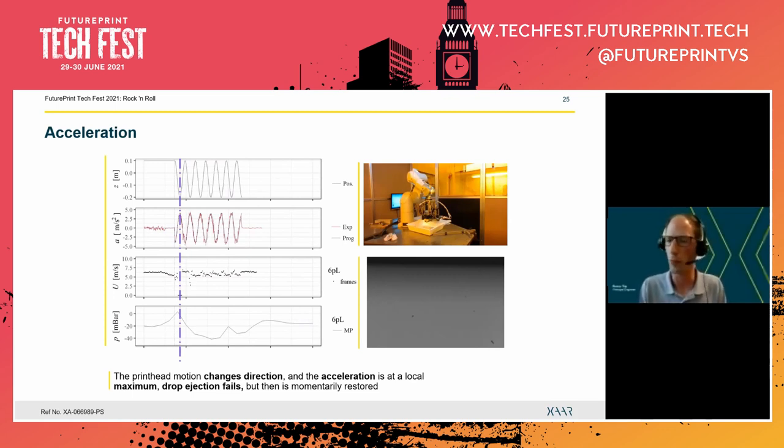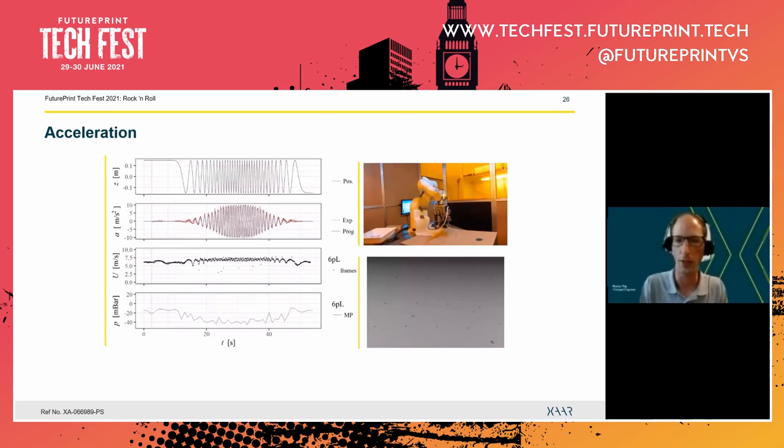So when we saw this, we thought, maybe we can actually do a smart trick. What if we don't start with the maximum acceleration, but we just slowly accelerate the printhead? So we slowly increase the maximum acceleration that we have during an oscillation. And that's what I'm going to show you in the next video. So again, we lift the printhead up first, and try to look both at the motion of the printhead and the drop ejections.